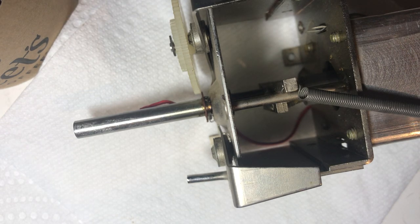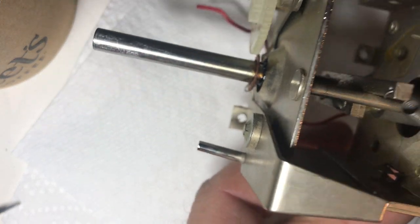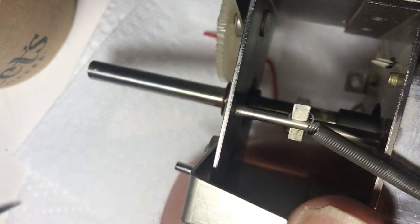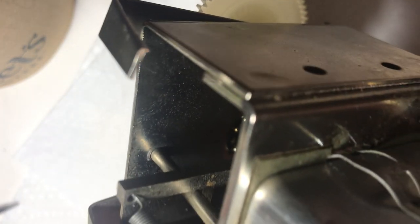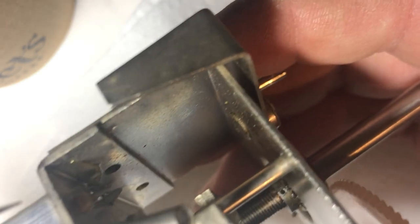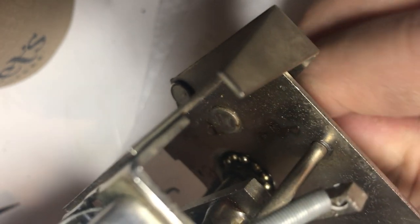Hello friends and followers. Here's the PTO which is still apart from the T4XC. I've removed all the grease from the bearing with Q-tips, just rotating this thing and taking advantage of the grease coating the bearings and removing it. So that's all done — these are now bare with no grease. It's time to put this back together for real.